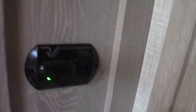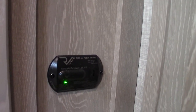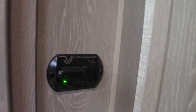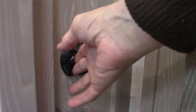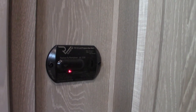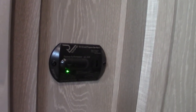This is a carbon monoxide and LP gas detector — it should always be green. It detects carbon monoxide buildup and LP gas leaks. If it goes off, take everyone outside, leave the door open, shut the gas off up front, and figure out what's going on. If it beeps very slowly, it's telling you the batteries are low. Putting it through self-test shows LP check, carbon monoxide check, and low battery alert. If it's not green, get it serviced — it's very important.